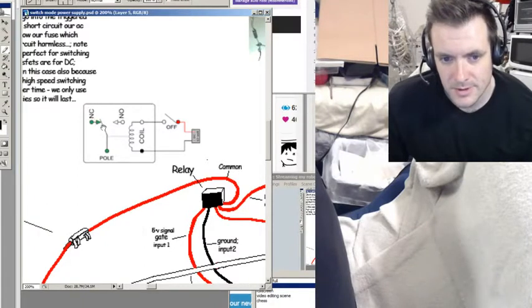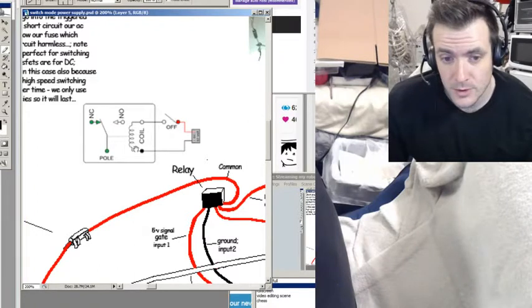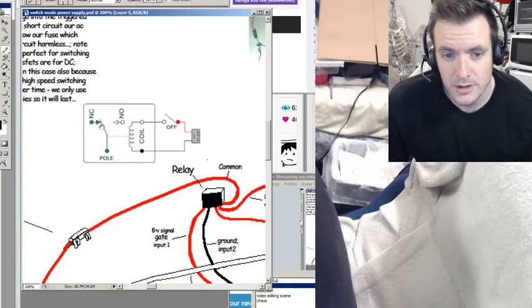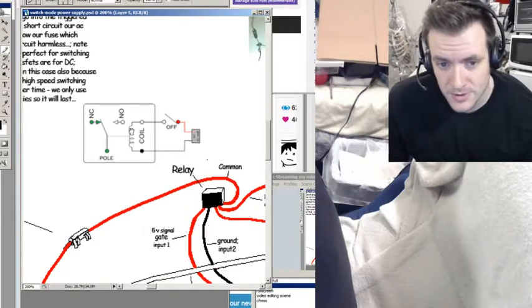There's probably a spring on the switch keeping it facing left. When this coil has power running through it, it creates a magnetic pull on this switch which is off to the left, forcing it to the right into a normally open state. So when you put a current through the coil, the switch goes from normally closed to normally open because the magnet pulls the switch to the right.